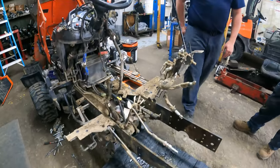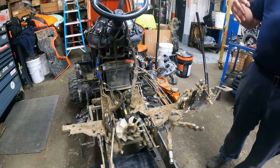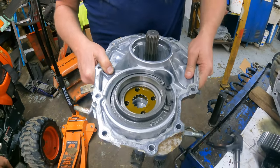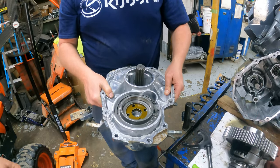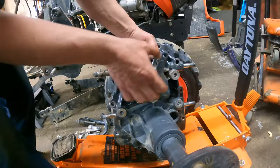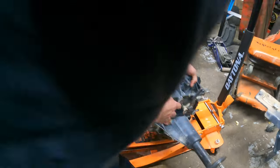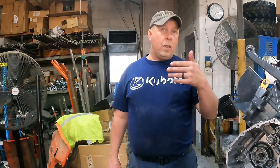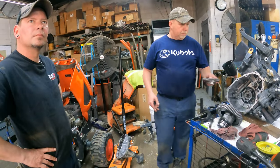Your brakes are good — we checked them yesterday, no reason to get in there and change them. That big snap ring comes out and your brake clutches are in there — it's kind of made like a clutch pack on a motorcycle. It's packed pretty bad, so when you clean it you need to pressure wash and get that case clean. Also watch for rocks getting in there, because sometimes a rock will stop that lever from actuating — you'll think it's broke but something's jammed up in there.